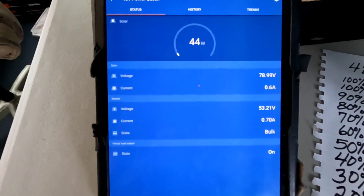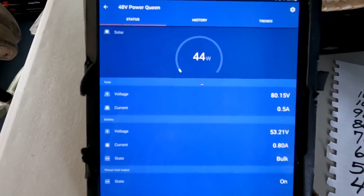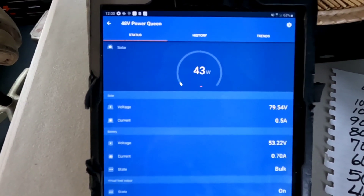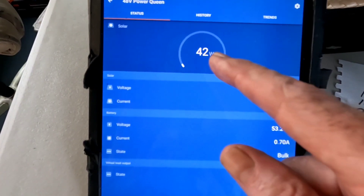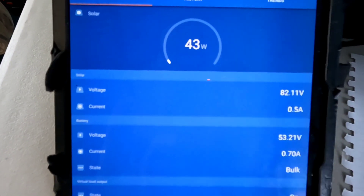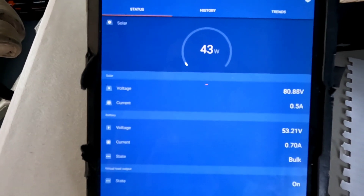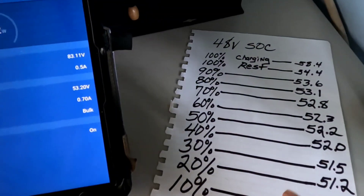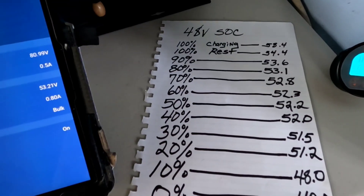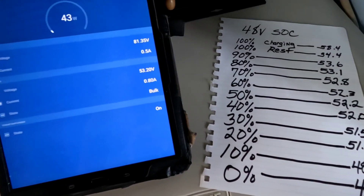I was really hoping to be able to show you guys what those panels look like in full sun — it's about 12 noon right now. If those clouds moved out and gave me full sun, I'd love to see it up around 500 watts and see what the voltage does. It keeps fluctuating around 80 volts. Everything's looking really good; it's just going to take me a little while to get my head around all these various numbers with 48 volts — quite a big jump from 12.